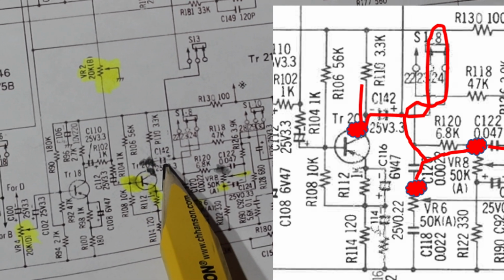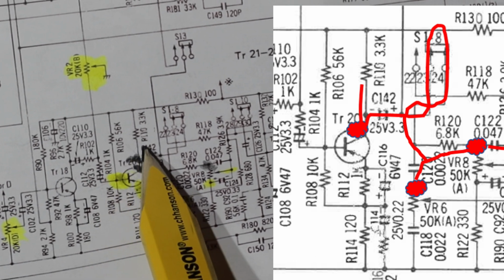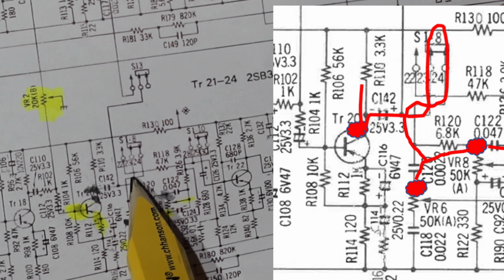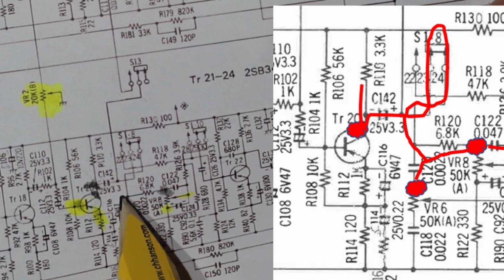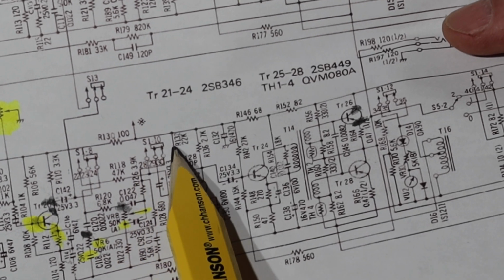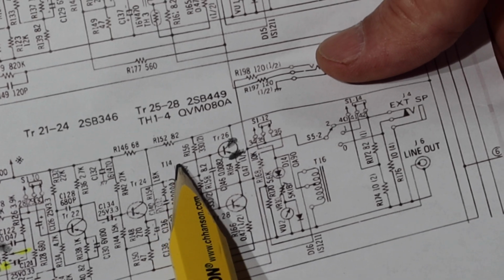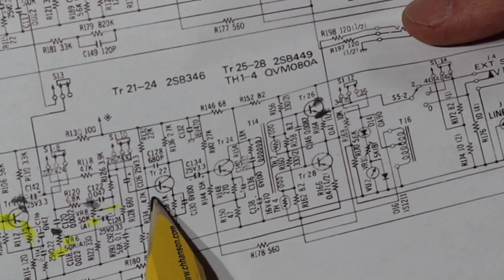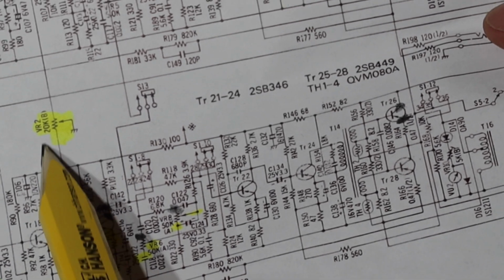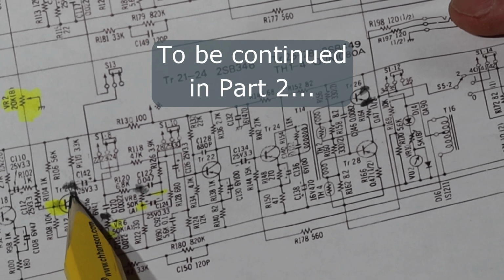So let's see, since we know this is quiet here, or at least I can't hear it, either it's all getting amplified and coming from TR20 or one of these other components around here, and getting, let's see, where does that go? From here, it goes to this switch, comes back out of that switch, comes over, and comes to this point where we had noise here and here. And then from here it goes into a switch, comes out, comes into 22, comes out and goes into 24, goes to the transformer, and then gets into 26 where the power output is. So we've got a chain of events, and we found an early point here. I didn't hear anything on this side of it, and that makes sense because we didn't have anything here on the balance either. Alright, so either TR20 is noisy or one of these other components.